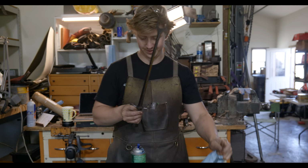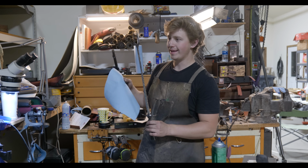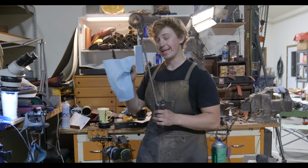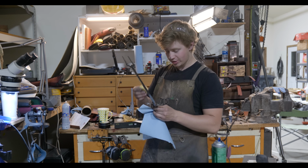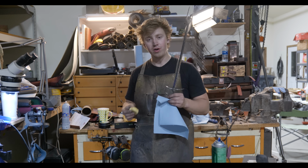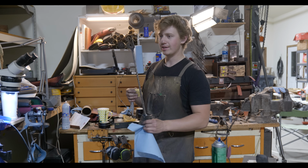Oh my gosh. And now I'm going to do something that I did on one other piece that I think would go well on this, and that is I'm going to heat it up with a heat gun and then put some carnauba-based wax on it. This stuff dries hard, and so that provides an awesome layer of protection, and it should really help that Damascus to pop.